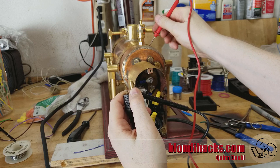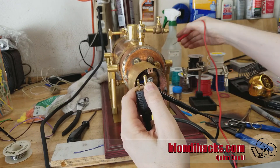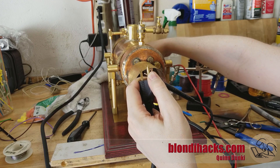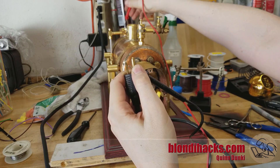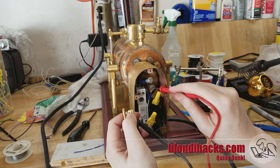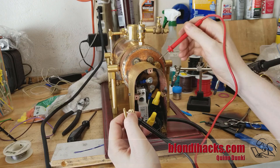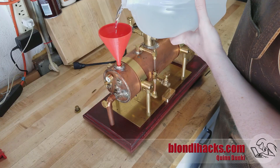And lastly I'm just checking continuity to my ground pin to make sure everything is going to be safe. Every single metal part is successfully grounded. And then I do the same with all the live and neutral wires as well, to make sure they are properly connected and also not shorted to any of the other metal parts. And we're ready for a test.